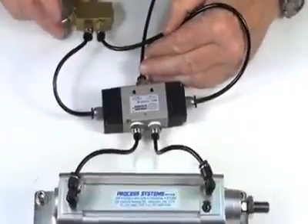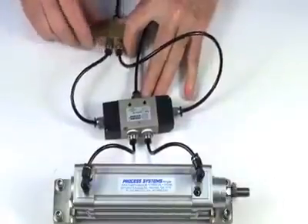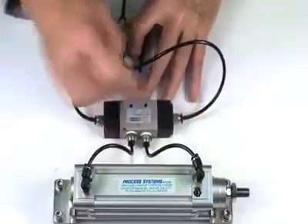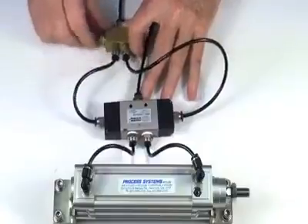Demonstrating the assembly — here's a little 5-2 valve to operate this. So we're putting an air signal onto there, or air signal onto there, and that's switching this 5-2. You can leave it in one direction and operate that way.